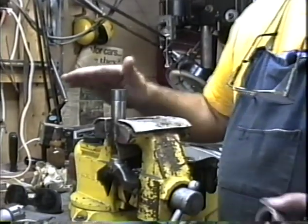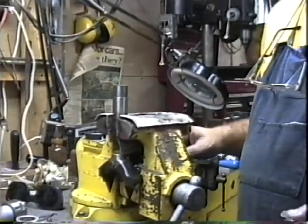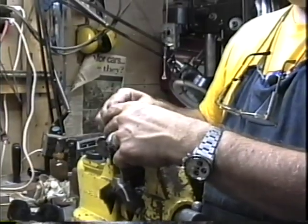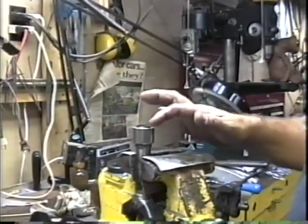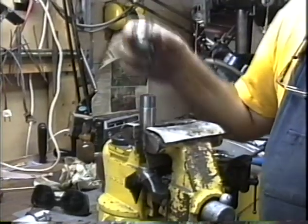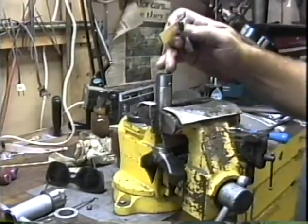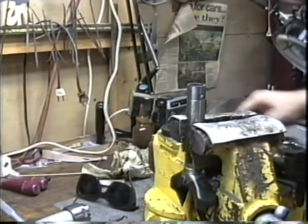There are a couple of ways that we can clean the top of that off, and I'm going to use an 8-inch half round file to do it, which is my favorite file. One way is we'll put the dummy headset on there, and as we file it, we can look to see how close it comes to the dummy headset. The other way would be to put a machinist square on there and crisscross it like that and just get all 4 of your readings to be the same height. Either way would be just as accurate as the other.